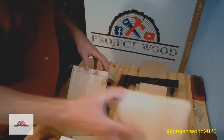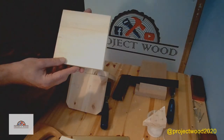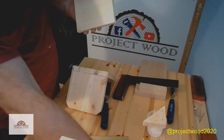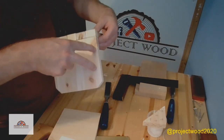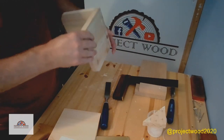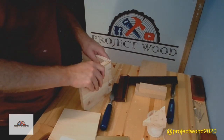And the final stage then is to fit our base. So we're just going to be putting four screws in there. Possibly a fifth screw as well if the step is a little bit loose, but I think that worked out pretty well. And we've got four screws to put in to the top to hold the roof in place on the sides. So we'll come back to that in a few minutes, and then we'll be ready for sanding and putting on our exterior finish.